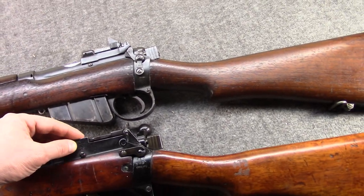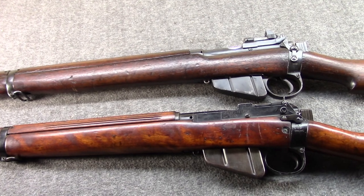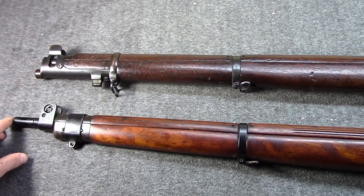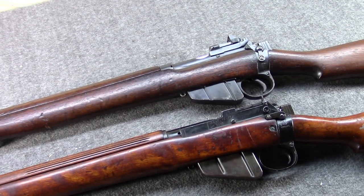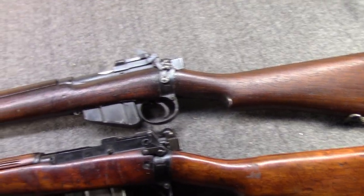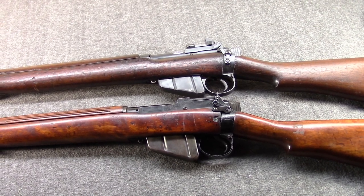The Number Four is slightly longer and you can really see the P14 influence. We have a longer, heavier barrel — about 26 and a quarter inches — and they did what they could to try to free-float it. We also have a newer adjustable sight based on the Mark V design but made better for mass production. They also made the receiver more squared off — fewer machining steps, easier to produce using modern tooling, and also stronger. The stripper clip guide bridge is now a whole single unit. All these changes added weight: this was over nine pounds, not as heavy as the P14 but a little over nine pounds. To help the soldier, they went away from the sword-type blade bayonet to a very simple spike or short blade bayonet, making the kit a little bit lighter.